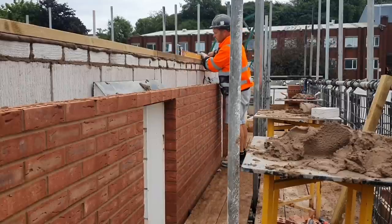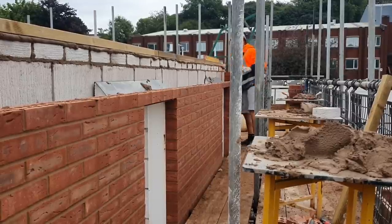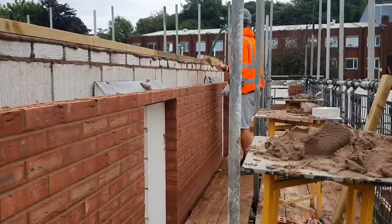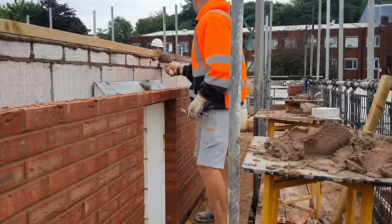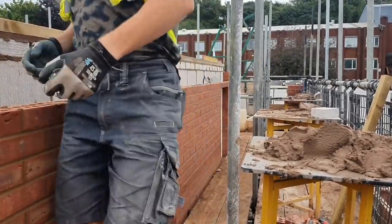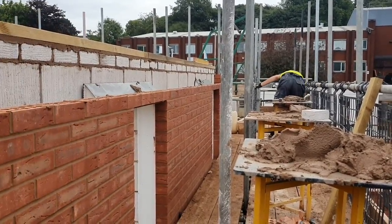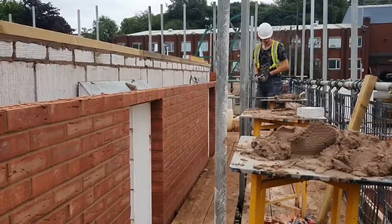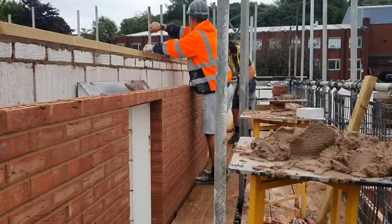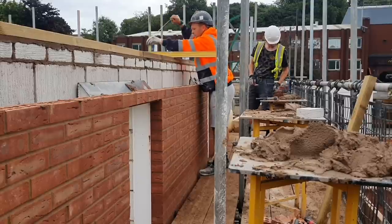That's nice. Even though it's a bowed bit of timber, that is perfect. And I mean perfect. That'll do us. Right, run me trowel across. Do you want to joint this back first? Yep. And then joint the inside after. That's pretty good. Job done. Right. That's finished height. Like I said, I'll double check the height now from floor. Let's see what this height is, eh? From the floor, use this level. That's tilting up a little bit. 2437 we're after.